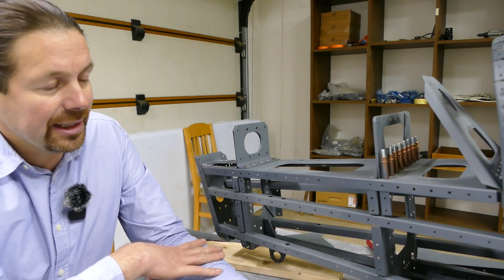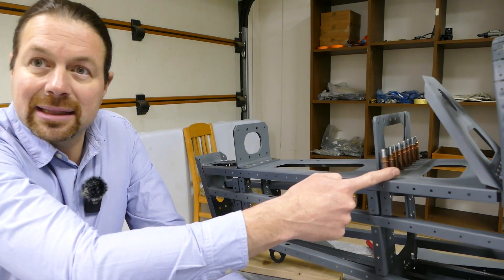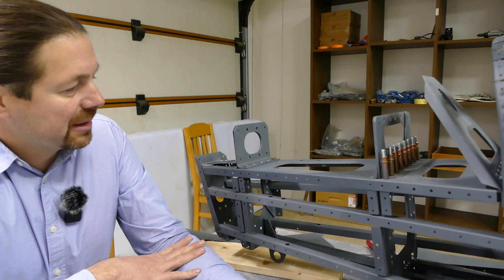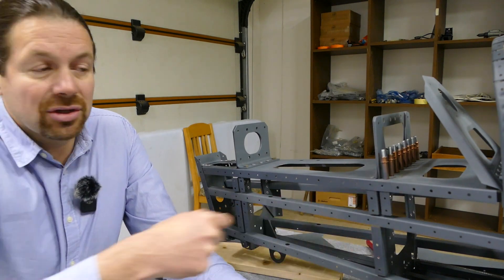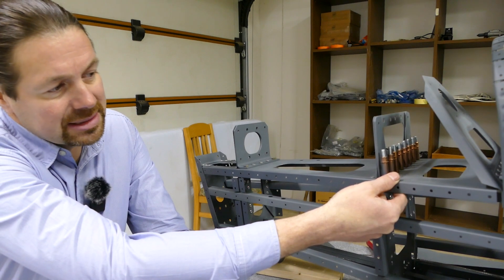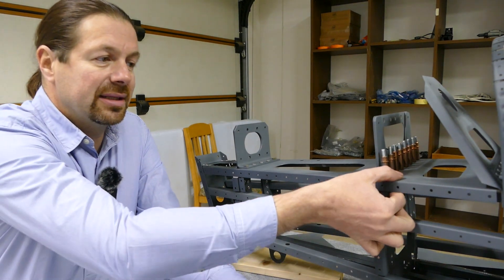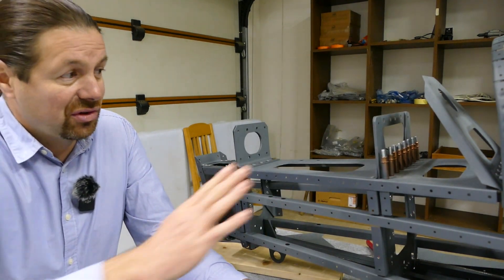This behind here is quite okay, but I had two problems with this build. I still don't know which rivets come in here. The manual says these are 3.2mm rivets but 12mm long, and this is very thin here. I don't know whether you have to use the 8mm or the 12mm rivets here. There are only a few 12mm rivets in the kit box and the number doesn't fit to those.